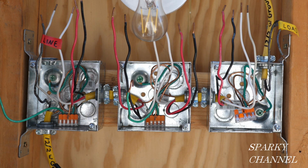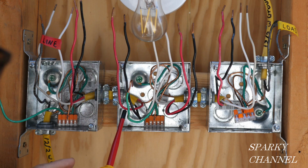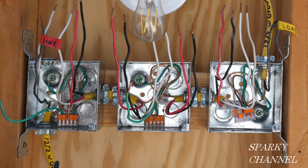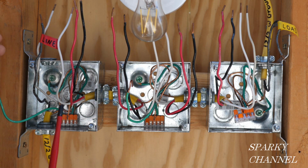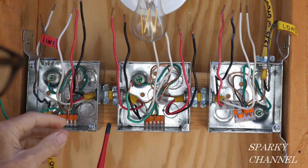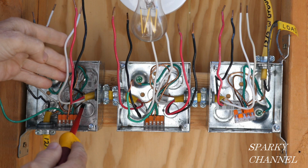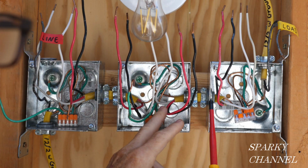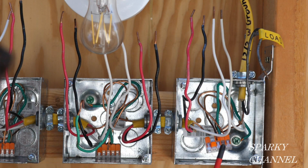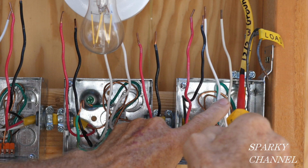And we have a cable coming into this system right here, bringing the electrical energy into the system. And this is a 12-2 with ground cable. It comes out right here, and then over here we have a 12-3 with ground cable. You see, a 12-2 just has 2 conductors. It has a black and a neutral, and it has a ground wire that is back in the back of the box right now. So this is a 12-2 with ground coming in, and then going over to the next box, we have a 12-3 with ground. So here's the 3 conductors right here. We've got the black and the red and the white, and it's got a ground wire right here. And it comes out over here. This is a 12-3 with ground right here. And then over here we have another 12-3 with ground coming to the last box. And then going to the light, we have a 12-2 with ground. That'd be a black, a white, and a ground wire, and that goes to the light.